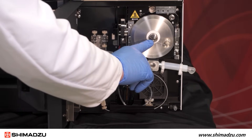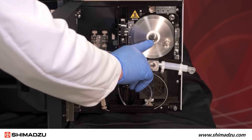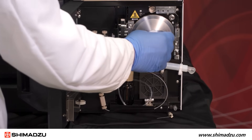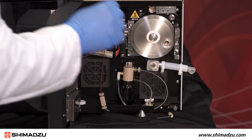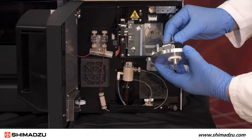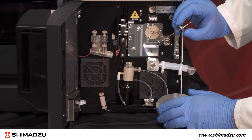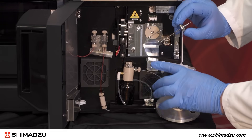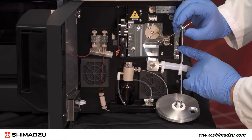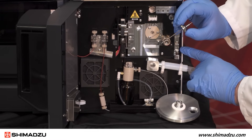The inlet to the vacuum region is here. We use a heated metal capillary called a desolvation line or DL to introduce the ions. Note that the APCI needle and heater cone are easily removed without the use of tools. This is the desolvation line. Note that I have removed it from the MS while the system is still under vacuum. No moving parts are required to maintain vacuum during this procedure — it is simply the design of the orifice behind the DL which maintains the vacuum. The DL and inlet system have been engineered to be robust and to stand up to lots of samples.